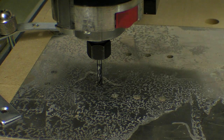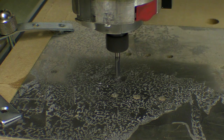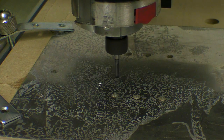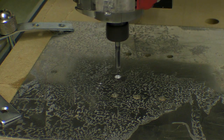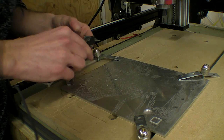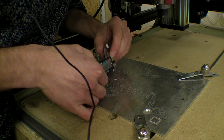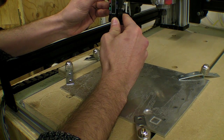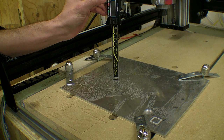I used a little bit of isopropyl alcohol. I think I'm going to change the feed rate to maybe a third less. Yeah, it's 5.22 — that's pretty good. And then I just want to check the depth — should have gone down 4mm. It's bang on 4mm.